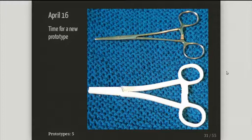The way I tested the tool head was to see whether it applies force to the grips — that's the function of it. I took a plastic bag, put the original hemostat in, locked it, and tried to pull it out. I repeated that with my printed model, and it was much inferior to the metal model. So I was thinking: how can I fix that?